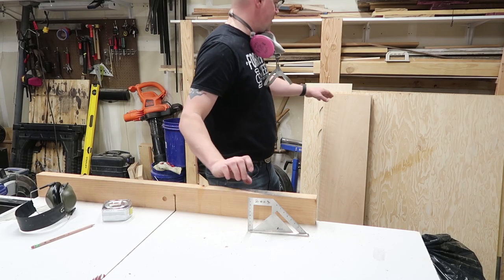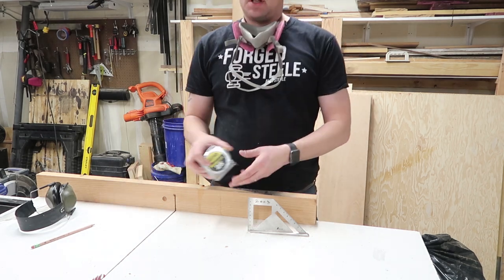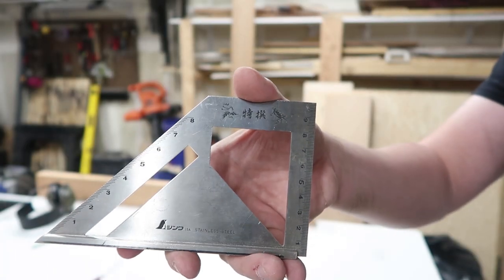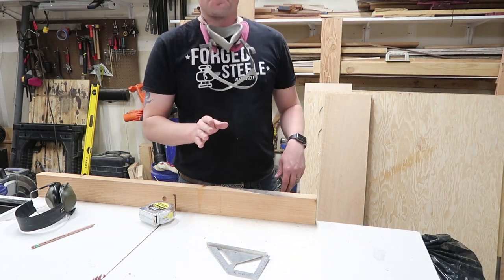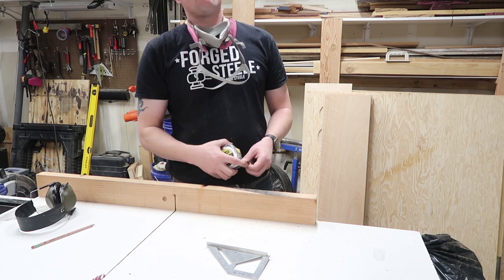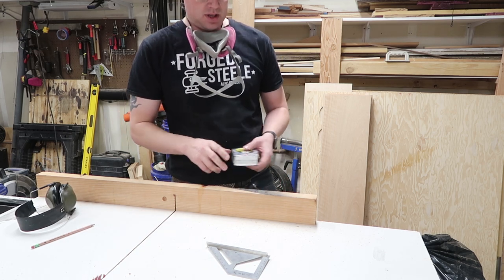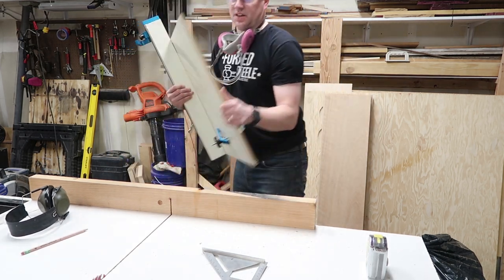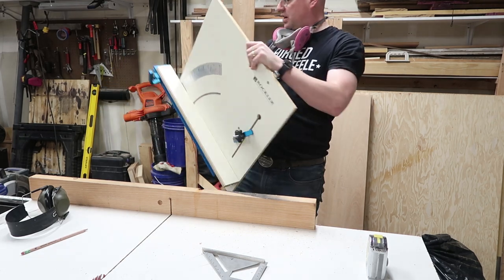Now I have that one side squared and marked so I know which edge I'm using. I'm going to measure them out and check my math with the tape measure. One of my favorite squares I'll use just to mark the edge — I don't have to put the line all the way across because the table saw is square. I verified it using David Picciuto's method: cut, keep flipping that corner, and you'll see if your piece is perfectly square. I also have a smaller Rockler sled I bought with profits from the coffee table; I've only used it once.